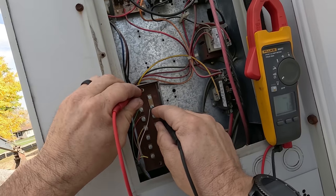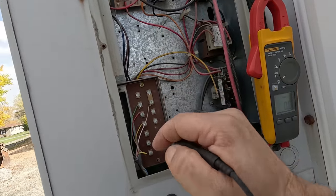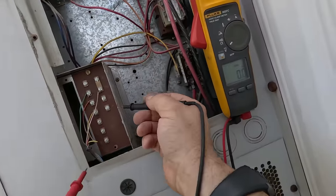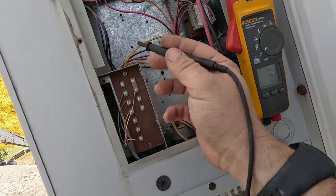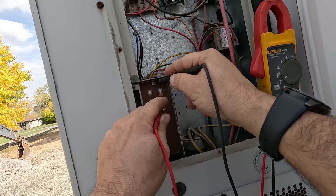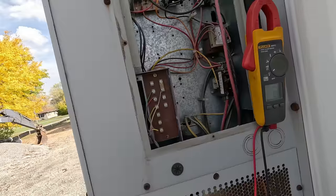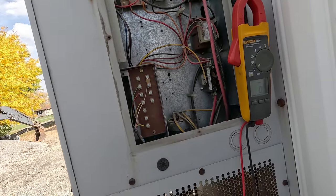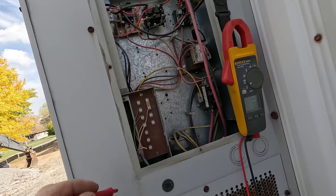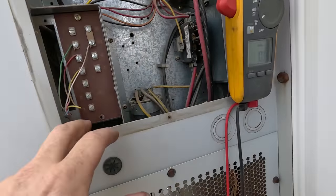Let's go to ground. Holy macronies - we have 120-some volts on that W terminal. I am afraid you're going to get zapped. Let's go from the metal screw to that - we have 124 volts AC. That could hurt just a little bit. I am not sure why that happened, but we need to turn off the breaker, see if it's dead, and find out what in the world is going on here.